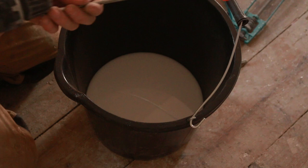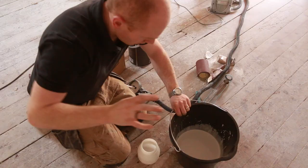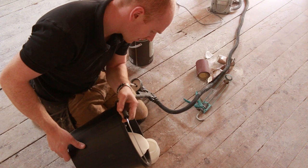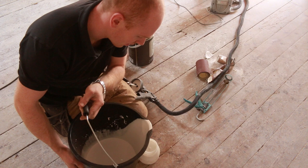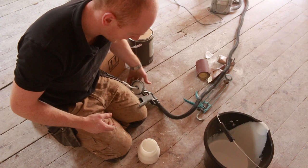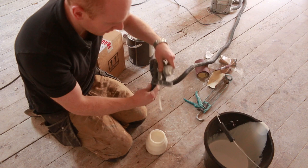The main benefit of spraying clay paint over any other paint is that we don't have to worry about any of the odours in the air. I'll probably wear a dust mask just in case, but to be quite honest this is as organic as it comes when it comes to paint. I'd say it's not far off what a normal mist coat would be — it's quite thin but still obviously a good solid white.